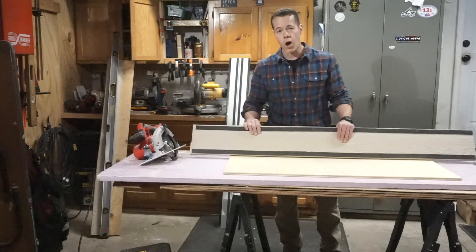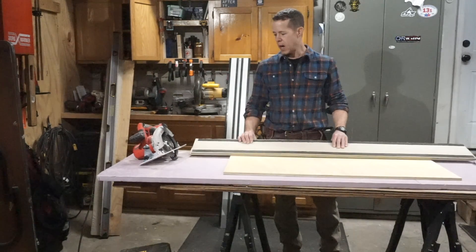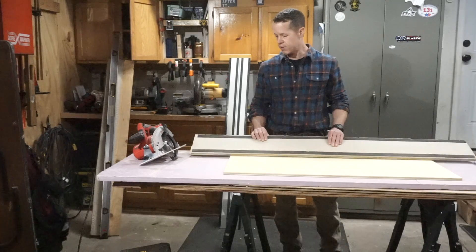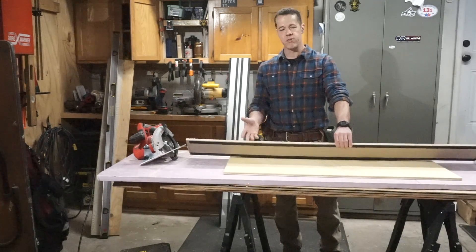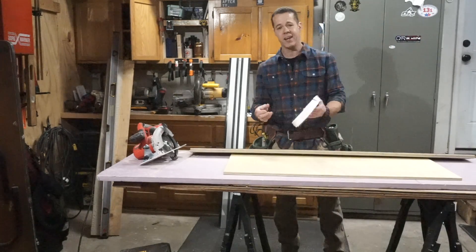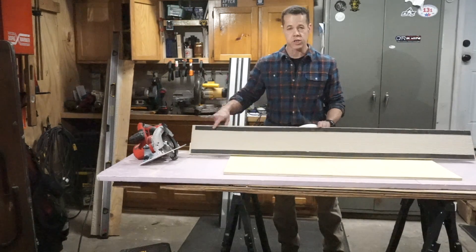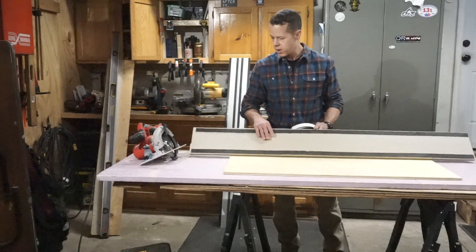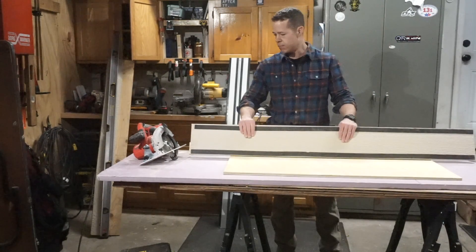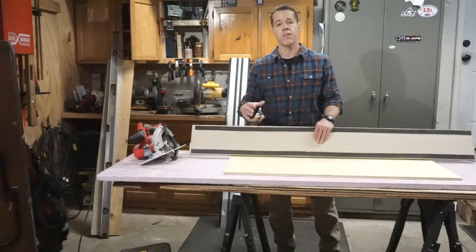So there you have it — a very low cost, very viable alternative to the expensive track saw, whether that's the DeWalt, Makita, or Festool. Is this going to replace those tools in a cabinet maker's shop? Probably not — I still like my DeWalt track saw, it has its time and place. But for making quick straight cuts, I use these straight edges all the time, and my main complaint was wasting time with clamps. This roll was only about $10, so I could make several track saws, and when the foam gets damaged I'll just replace it. I'll probably add another strip to increase surface friction and prevent movement during cuts. Hopefully you liked this video and learned something — give it a like and maybe subscribe. Thanks for stopping by and I'll see you next time.